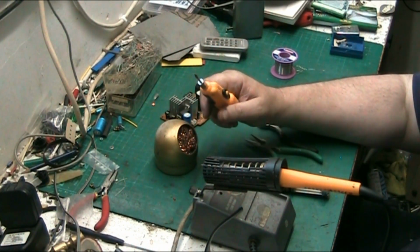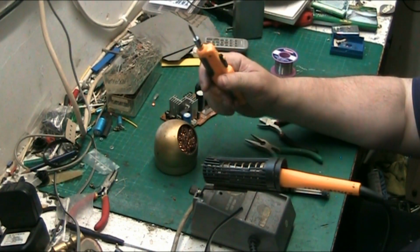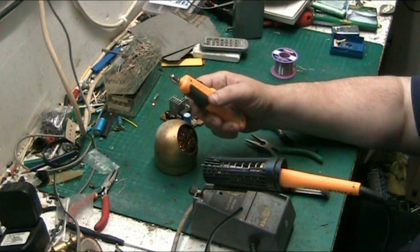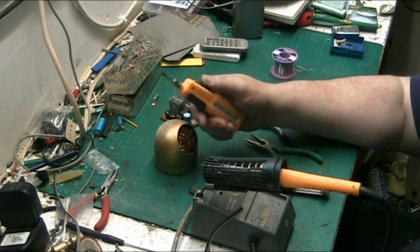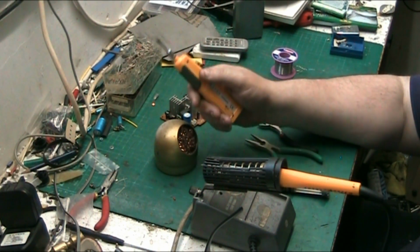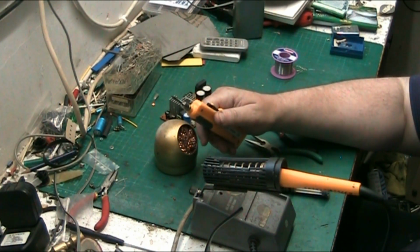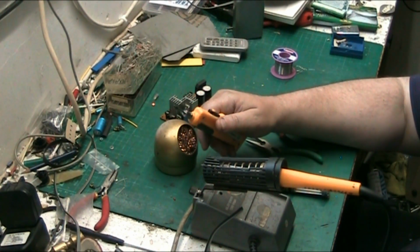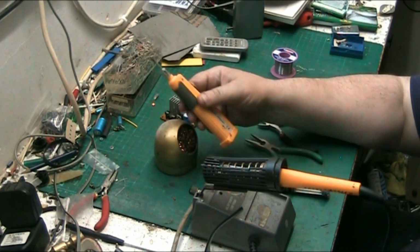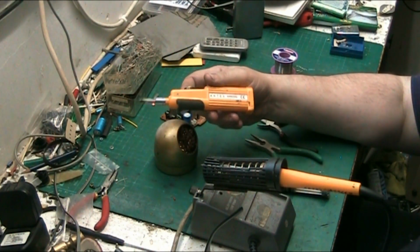Because I had an idea I wasn't pulling a line transformer or flyback for my American viewers. As I knew I wasn't pulling out a line transformer or flyback transformer, and I was already told that the fault was intermittent. If you give it a kick, or bang the top or other side, it came on, so I knew it was just dry joints. So I just took this little fella with me, and he was able to accomplish the task with ease.